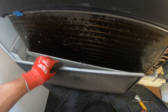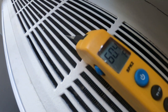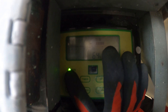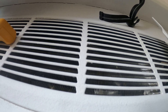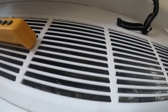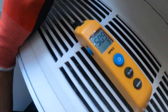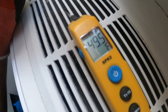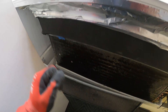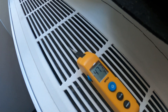This unit definitely needs a cleaning — it could be brushed down, very dirty. Sounds good and we are running. Let's test the fan speeds: low speed, then high speed — okay, it definitely switched. Looks good. Temperature went down a little bit too low last time, but if it works it works. I'm going to brush this down and clean the filter, and we're ready to roll.